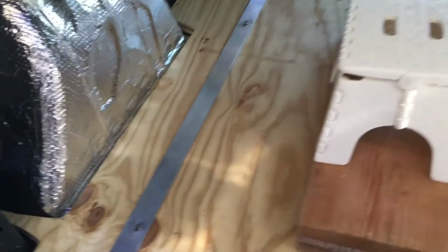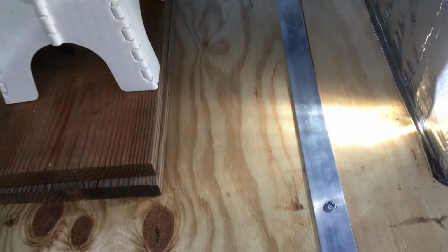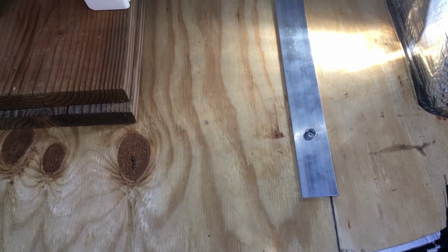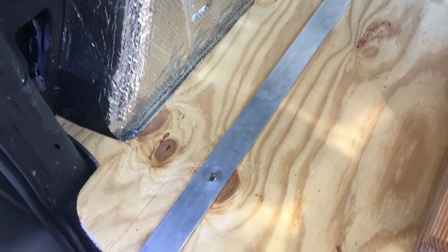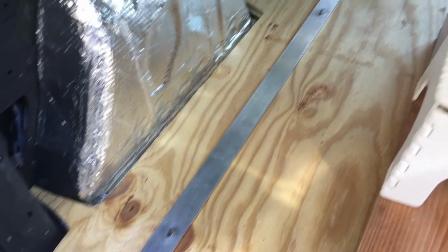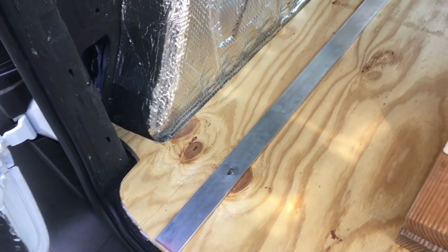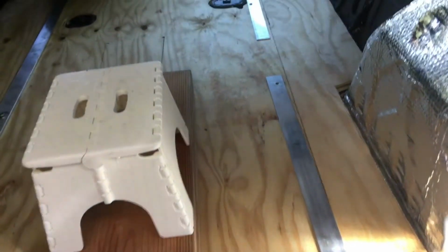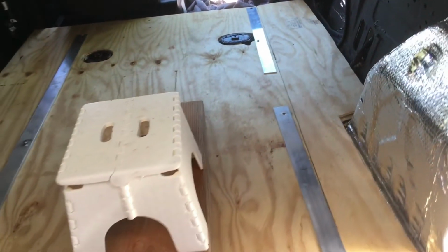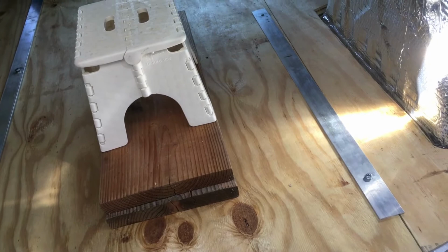The other thing that I want to draw your attention to are these 2-inch bars of aluminum that I have bolted to the floor. Now these are using the anchor bolt holes for tie downs that are provided by the manufacturer. The idea here is that these bars are bolted firmly to the frame of the van, and now I can essentially bolt my equipment to these bars, and that will make sure that they don't travel all over the place and hopefully represent a solid connection point for all of those pieces of equipment.